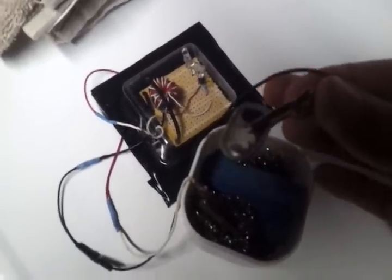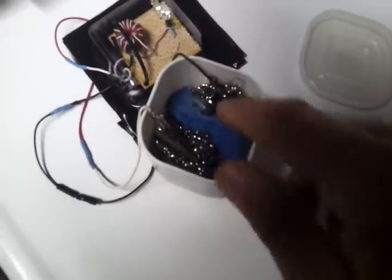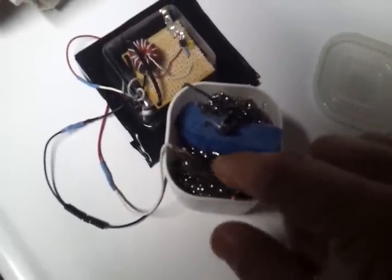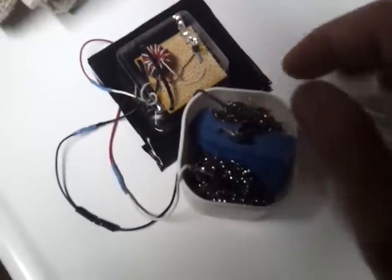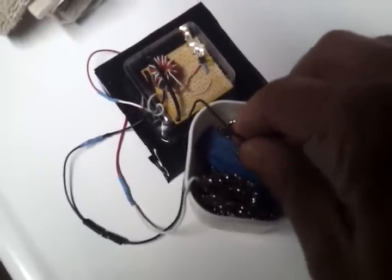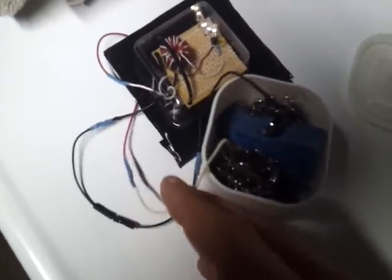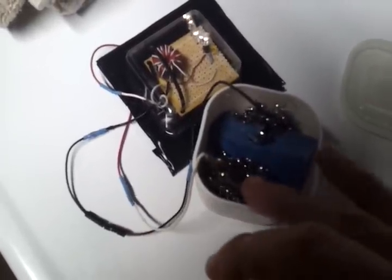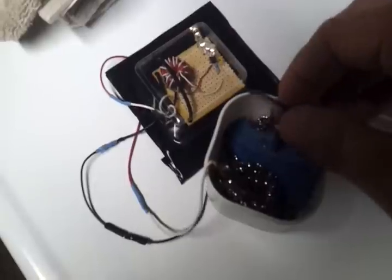You can find plenty of these tabs to create the effect. The sponge is just sitting nested inside this stainless steel pad, which does not get consumed. It's saturated with the sodium hydroxide solution at about 20%. The positive lead goes to the stainless steel and the negative lead goes to the aluminum.